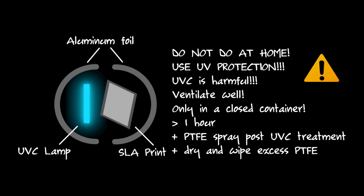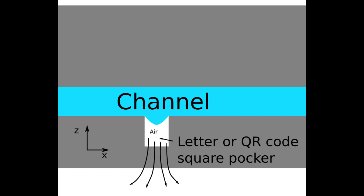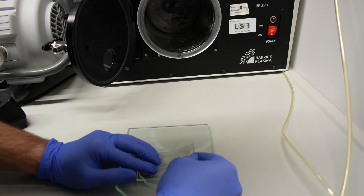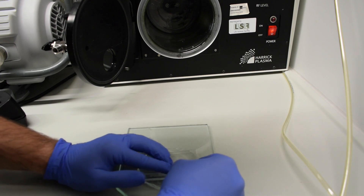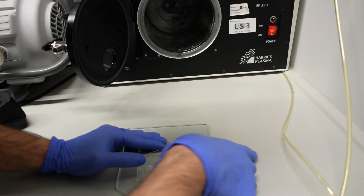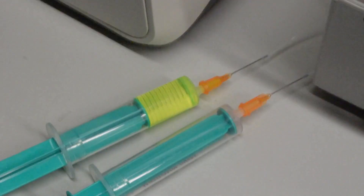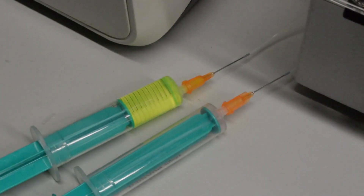This new solution even fixed a few other issues automatically. PDMS is air permeable, and with some pressure we can squeeze air pockets out. Also, it is flexible and thinner. So I punctured holes, bonded two pieces together, inserted pins, and there I had my device. Next, I hooked up syringes with water and filled up the device, then switched to another syringe with fluorescent dyes, slowly flushing the dye through the device. I placed the device on a UV light source to excite the dyes while recording it. Now we can all enjoy the show.